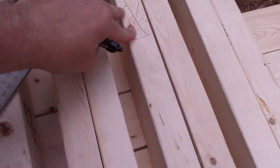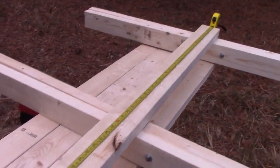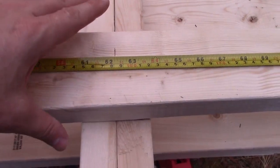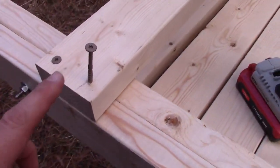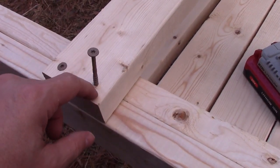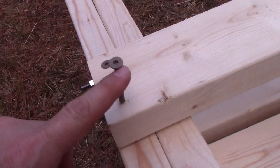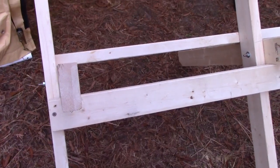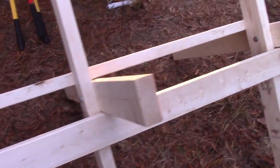The long support board is 93 inches. To get everything centered, divide by three — you'd think it's four pieces but you don't really count the end, which puts you at 31 inches per segment. Lay it out, remember which board you're attaching to, and put in two to three screws on each board, then flip it over and do the opposite side. A beginner tip: never put your screws completely straight down — tilt them about 10 to 15 degrees and they're exponentially stronger. You can also set the first X-frame up, lock it out, make sure everything's touching, and screw it in — this is a better way to do it, it just takes two people.